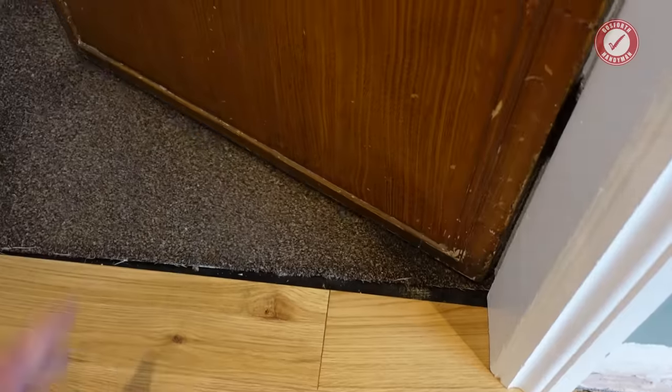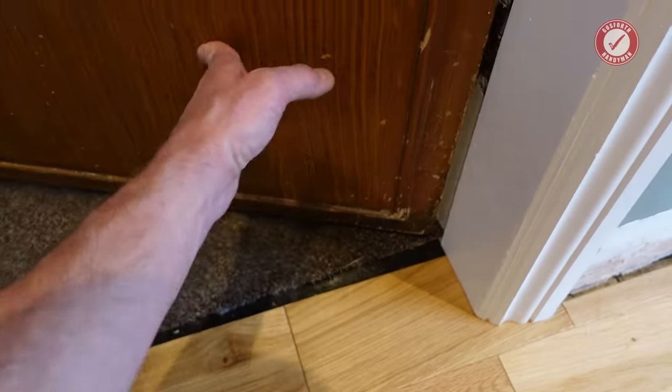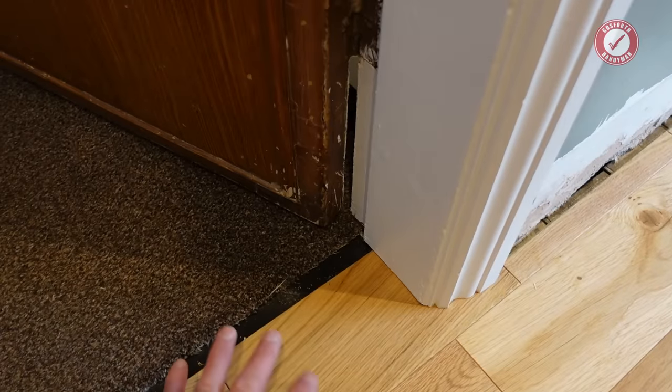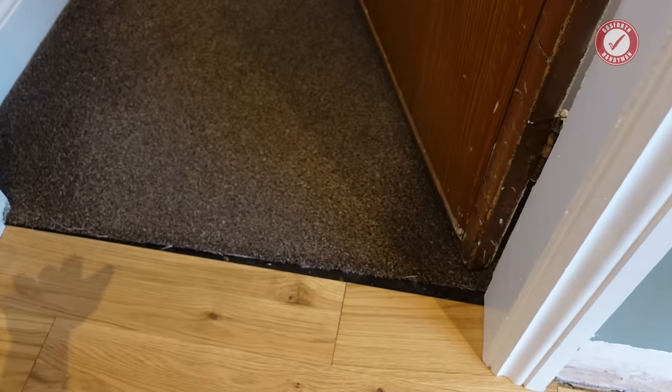This is a bit of a weird one because the doorway isn't straight, the doorway's on a bit of a slant, on a bit of a wonk. So obviously the threshold needs to go kind of here, and this will be a wood floor to carpet threshold that'll be going on here. But as I say, that's going to have to be an angled rip to match up to the threshold,